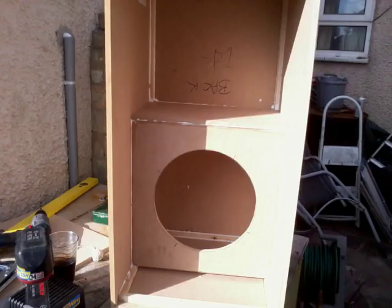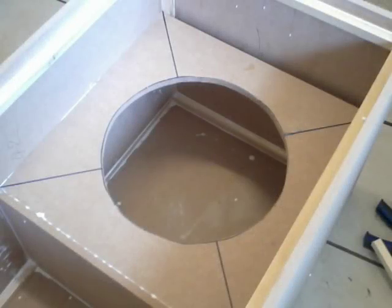At this point it's worth filling this boom box with some roofing wadding — this will effectively make the box twice its size. Also drill the hole in the top panel for the cable to run through; don't forget, it will be too late once you've sealed it. You can get the loft insulation at any DIY store.